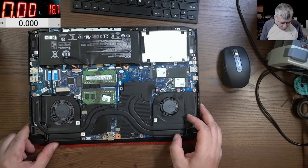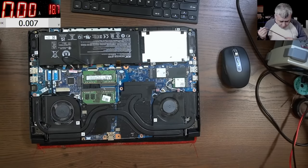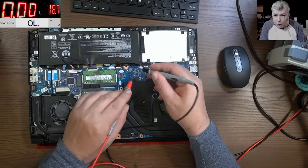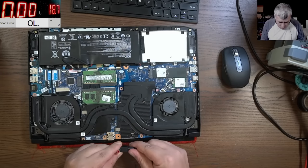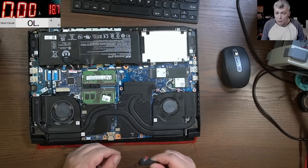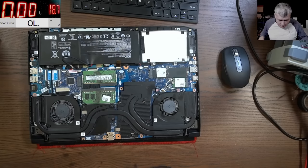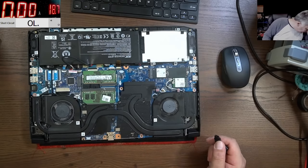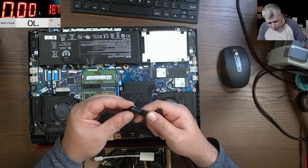It should be fine — no one has done the BIOS. Let's unplug the battery and check the main power to see if it's shorted. We have a power supply here and no short. I'll use my own charger rather than the customer's one. Let me grab the Acer charger and now on the power supply we can follow what's going on on the motherboard.